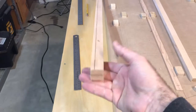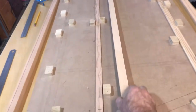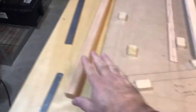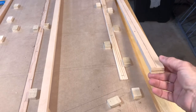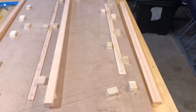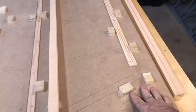This piece of wood is one inch square — that's going to get two rabbets in it to hold the gussets. The main spar in the center does not; the ribs go around that. The trailing edge will also have two rabbets in it to accommodate the gussets. This leading edge piece is one inch square, the spar is only three-quarters inch thick, and the trailing edge is actually only five-eighths inch thick. It's going to get some rabbets, and then we'll sand in a nice curve at the trailing edge.